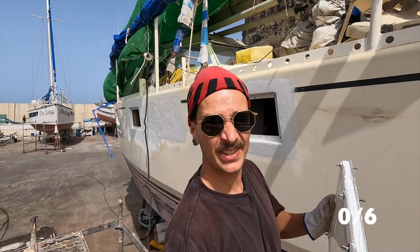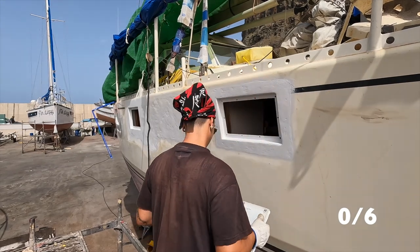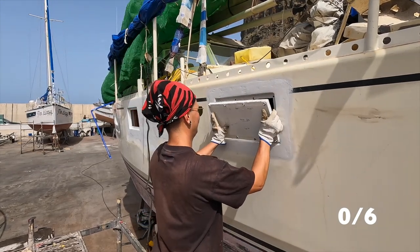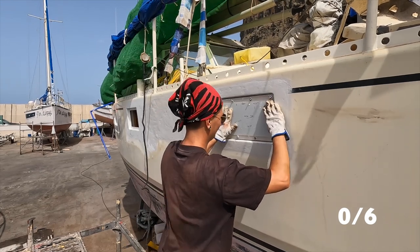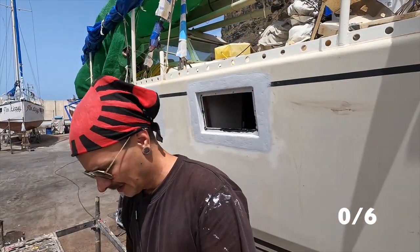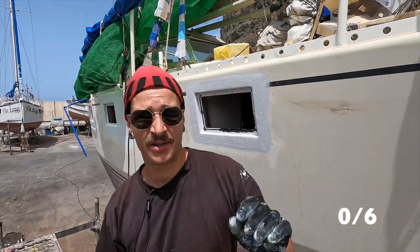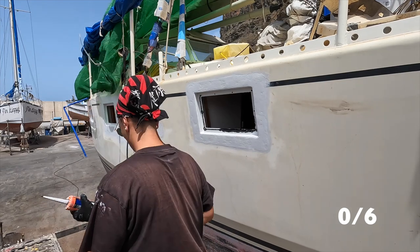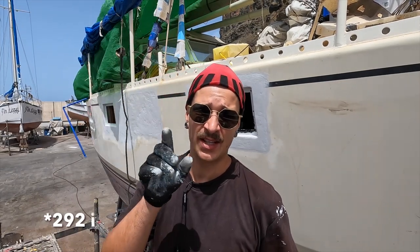First, we're going to do a dry fitting test, if this actually fits or if we still need to sand something off, which might be possible. Finally, time to glue. So we're trying to glue a nice Sika bead. At the end, we reach about 3 mm thickness. We're doing a different one now, 295i, because now we're gluing steel on steel.